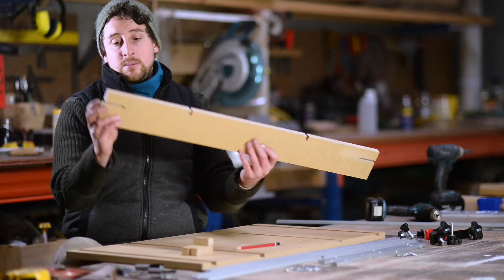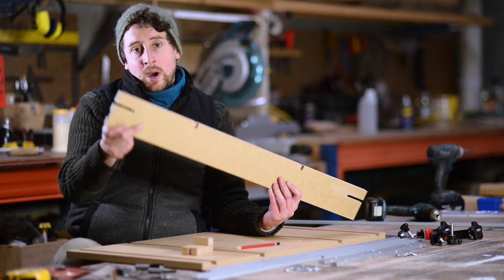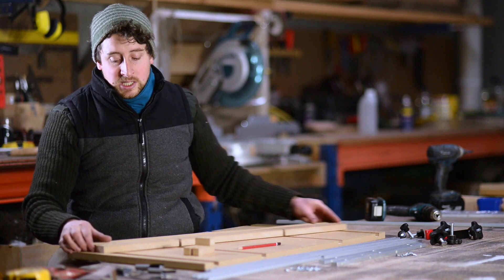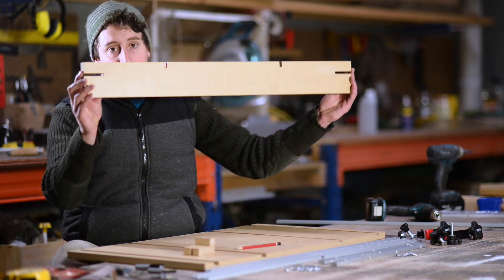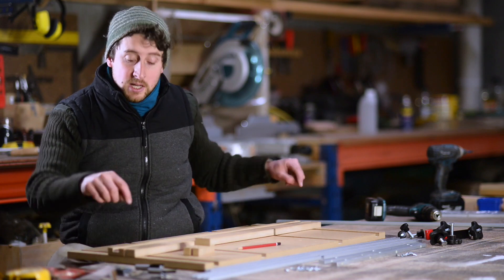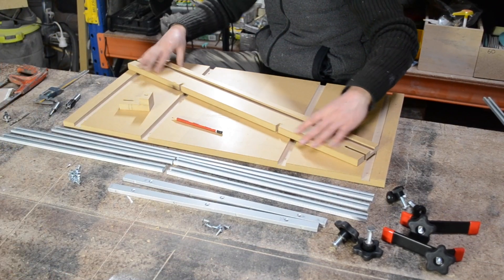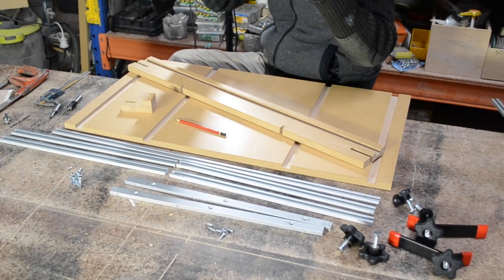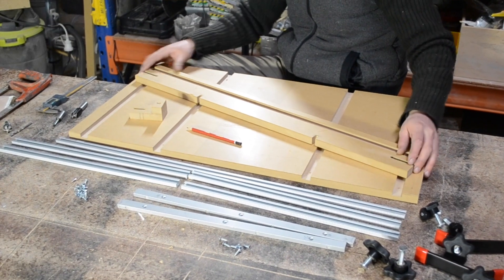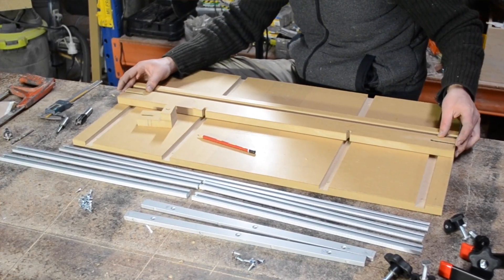I used that 8 mil bit in a couple of places on the jig. There are ways you could do this with an 8 mil drill bit instead if you didn't want a channel, but you really need that channel to give you the flexibility to slide the fence back and forth and put it on different angles. If you just had two holes, as you rotate the fence to get different angles, the distance between those tracks actually gets further apart in relation to the fence. That's why you need the play of those slots rather than just putting an 8 mil hole in each one.